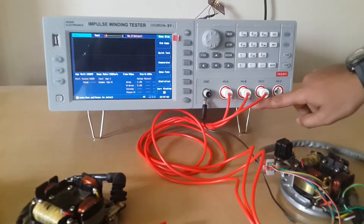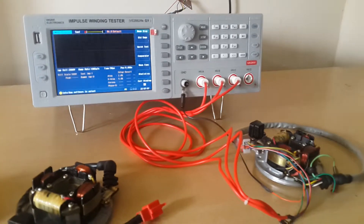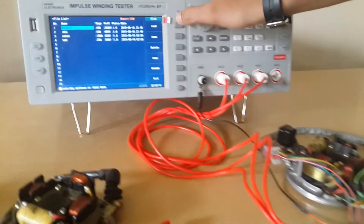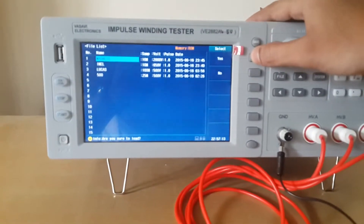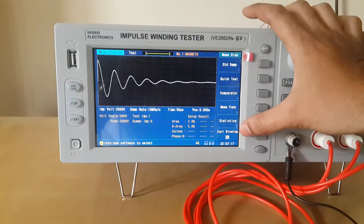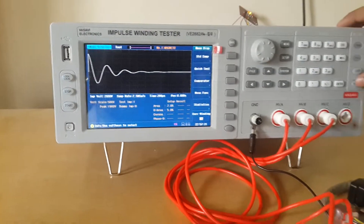This is a 4-channel 5 kV impulse tester. We are using this equipment for testing magnetos, which are for two-wheelers. This is how we select a predefined test program which we have taken to a standard. These are the waveforms taken from a standard for different coils of the same magneto.